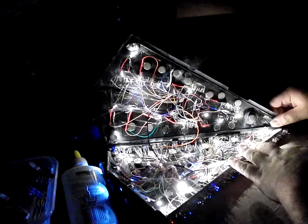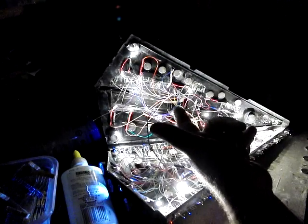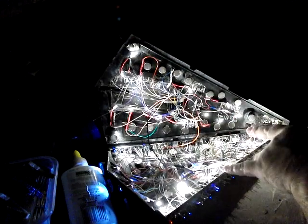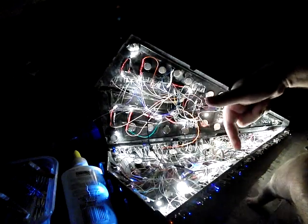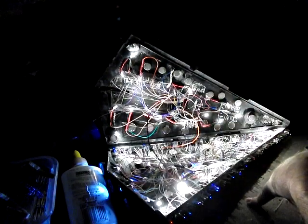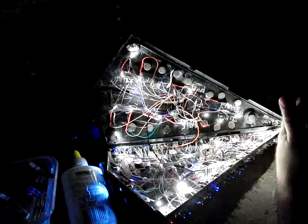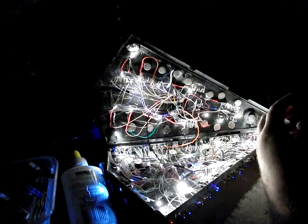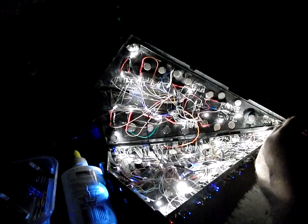Like I said there are 38 LEDs in here right now. I can definitely put at least one more orange and one more blue in the top of course — I still got to do that. Overall there are still some dead spots in the bottom; this little area here isn't so bright and I definitely need one there. I could probably put 50 in here, and with the thousand milliamps at 20 milliamps each I should be able to fit 45–50, so I'm definitely going to try and max this out.